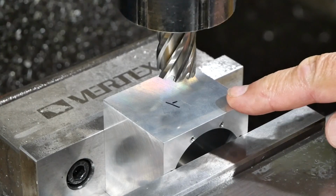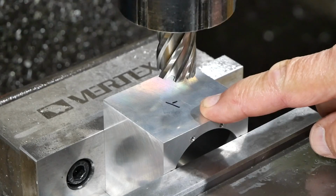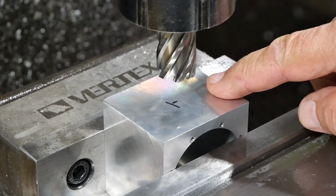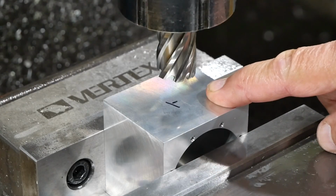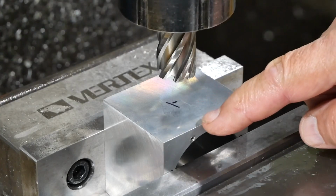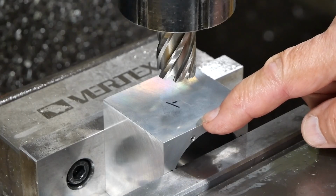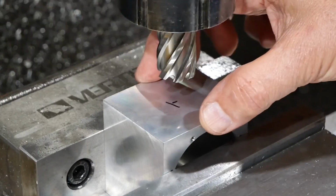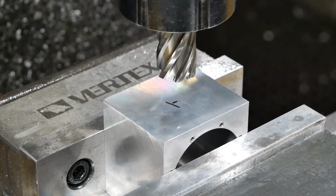So I've decided to use this crankcase. You might remember from the earlier video, it's just under 0.5 millimetre short on the length, but I've looked pretty closely at the drawings and I'm reasonably sure that that isn't going to cause me a problem. So then I'll have a couple of choices. I can either machine the bottom face of the cylinder slightly undersized all round, or cut a couple of flats either side, or just put up with it overhanging slightly, and I'll decide that later.